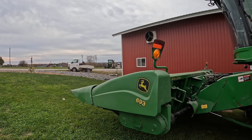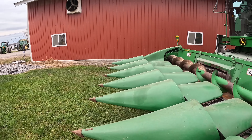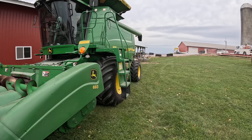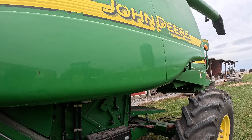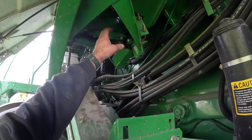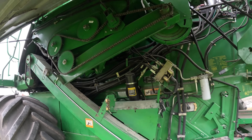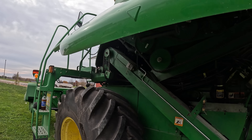If you recall last winter, we ended up completely rebuilding this head. We've got four out of the six — or maybe five out of the six — gearboxes have been replaced. And we are now ready to test it out. We also put a grain sump on this. All we've done with this combine so far is wheat. And this grain sump area here — the bottom side of this grain bed — we were leaking out back here. We were leaking corn. We ended up putting a whole new sump in there. We replaced both grain bed augers, the vertical auger, and the short section of the unload auger. The outer extension had already been replaced.